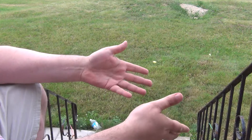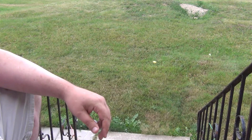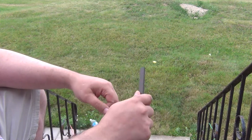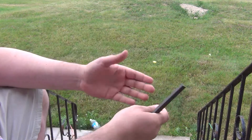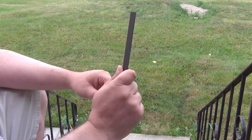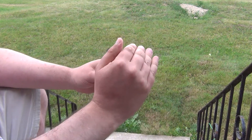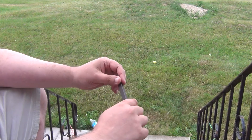Interestingly enough, the medium rods did the same thing — again, because the steel is much harder and stronger, it resists bending so it doesn't get that fatigue. Plus, I was doing a very low volume of cuts because the material was so abrasive, so the edge wasn't bending back and forth much. And because it was so abrasive, it would wear off any fatigued steel anyway. So the medium rods could achieve a very consistent level of performance in both initial sharpness and edge retention. The very last run was slightly lower, but that could be random variation — and I had to do quite a number of trials before I even saw that one dip.